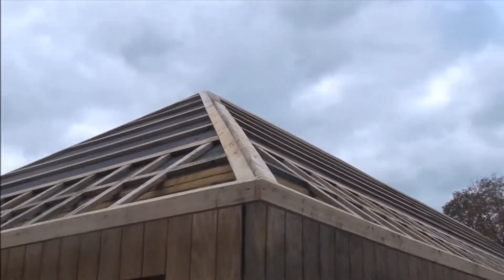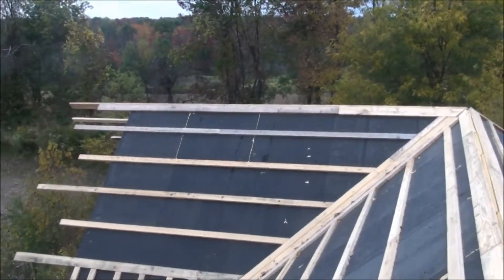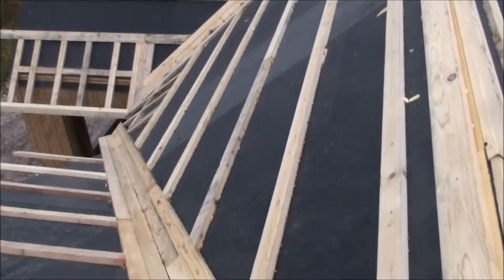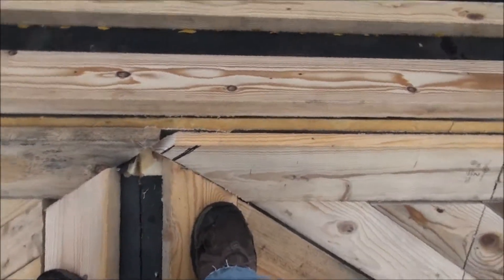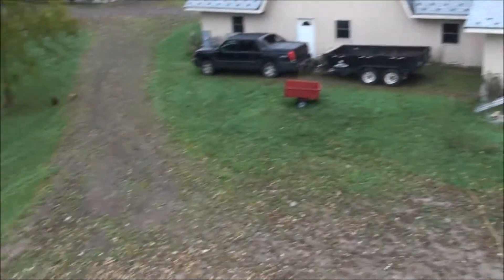I'll pop up there so you can get an idea of what this roof looks like from above. It's a little moist up here so I'm being careful. This is the chicken coop area over here. You can see the insulation underneath all of the 2x4s. I'm using 2x6s along the peak, double rows of 2x4s, and valleys coming down where each of the different peaks connect. Here's one of the hipped roofs, another valley, the workshop area, and some of the chickens down below.